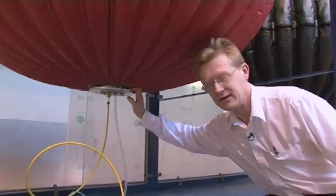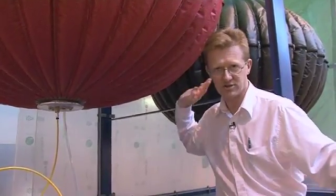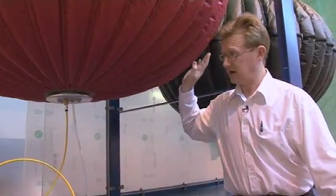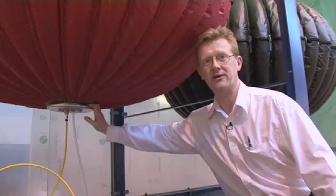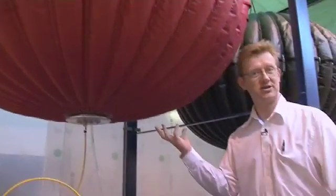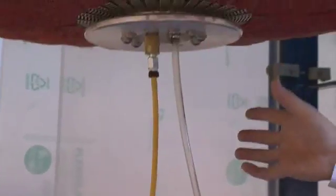In reality, that anchor would be onto a very large piece of ballast. The whole bag is pulled down with very high pressure water all around it. What the bag has to do is just keep the water out and the air in — that's an easy job for the surface material — and also withstand the buoyancy force. With two and a half cubic meters of air inside, you get two and a half tons of lift force that has to be pulled down, held by these special structural members. When you want your energy back, you let the air back out through a pipe that runs along the seabed and rises back up to the surface, going into an expander to turn a generator and make electricity.